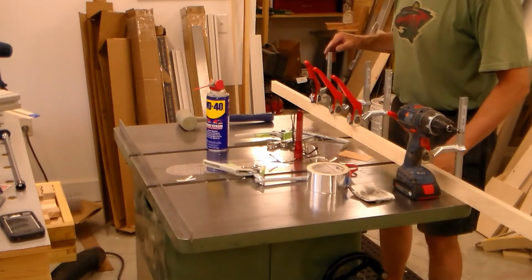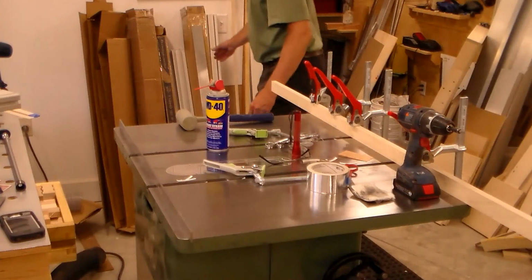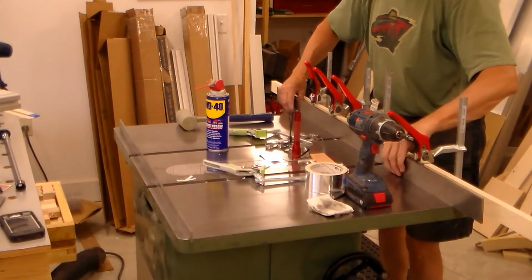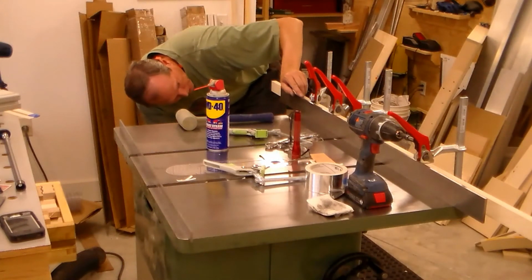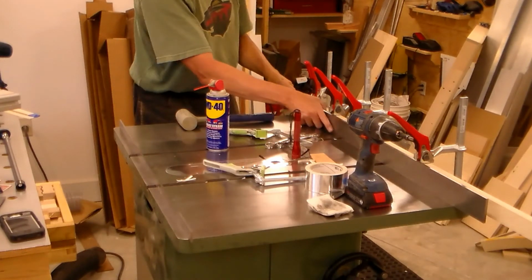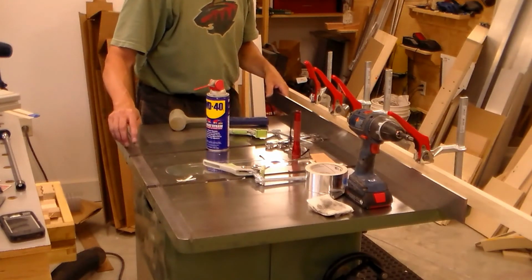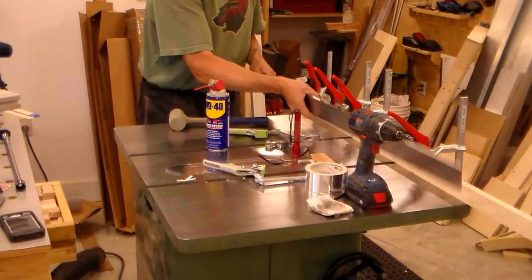But when I put my straight edge on there, which is over here, I've got it looking pretty good. So I have got zero daylight where it's flush right here. There's just no daylight. And it's as true as can be. And the same goes for this back part here. I got another straight edge on it. That is as straight as can be too.